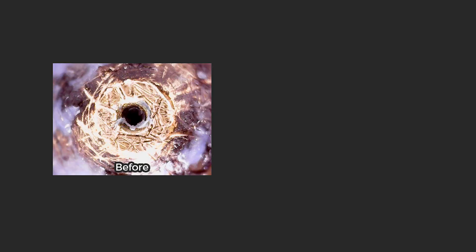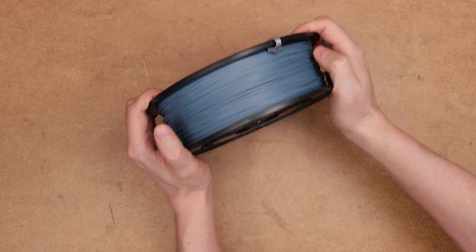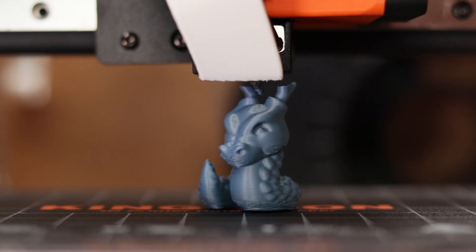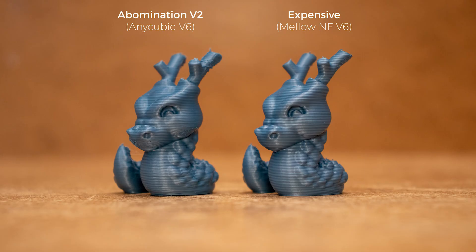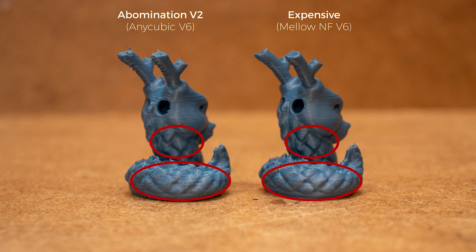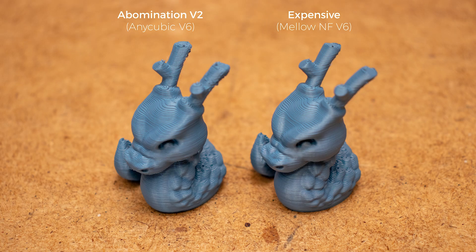But can we push it even further? Oh yes, we can. Behold the abomination V2, with a teardrop-looking hole and deep scratches. This time I will go back to PLA just to have a comparison with all of the prints — well, if it prints at all. The start was rough with poor adhesion that ultimately led to a failed print, but luckily the second one finished successfully and we can make a comparison. The first thing that catches the eye is the overhangs — they look way worse compared to the expensive nozzle. Also, there is more noticeable loss of detail and the dragon's skin part is smoothed out even more. But it is still hard to believe how bad your nozzle must be before you start seeing all these problems.